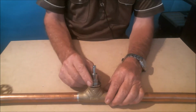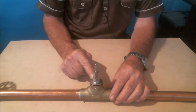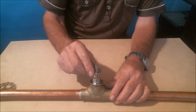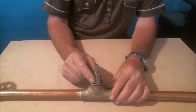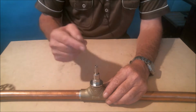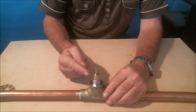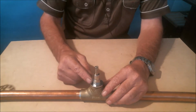The stem of this valve does not screw onto the bonnet. It is set in place using a snap ring. So turning the bonnet anti-clockwise together with the stem opens the valve and will get water squirting out. The only option in this case to separate the bonnet from the body so we can put hemp in there is as follows.